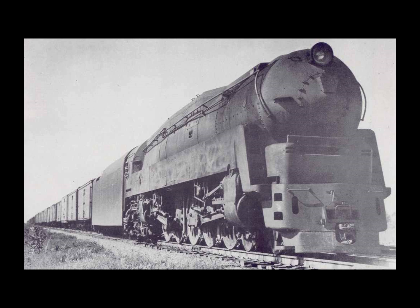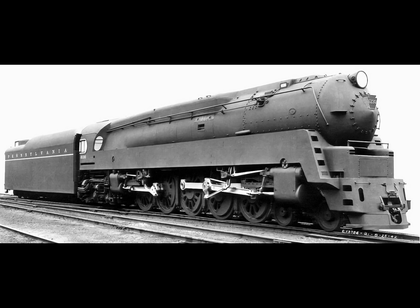The concept was particularly developed in the early 1930s by Baldwin Locomotive Works. The Pennsylvania Railroad desired to apply the duplex principle to freight haulage, and the Q1 was the first experimental step in that direction. It was a 4-6-4-4 wheel arrangement, a fast freight locomotive, delivered in May of 1942. Like the B&O's Emerson before it, it had a second pair of cylinders facing backwards, and all were fitted with Walschaerts valve gears. One issue noticed straight away was that the driving wheels were 77 inches, more suited for passenger service than freight hauling.